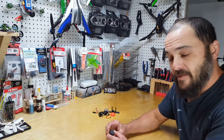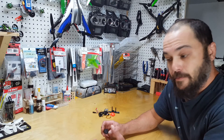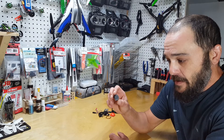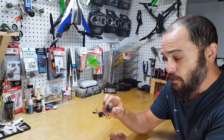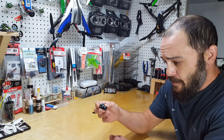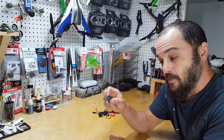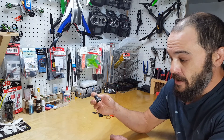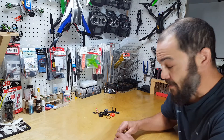The second item they sent me — three-inch machines are all the rage nowadays. Smaller is better, regardless of what kind of motors you're running, and everybody wants the minicams. This little guy right here is 800 TVL for resolution, 120-degree field-of-view. It comes with a wire harness for the VTX — just plug-and-play, ready to go. The coolest part about this thing is it checks in at 9.5 grams with the lens cover, so you can stuff this little guy into a mighty small machine and be ready to rock and roll with some sweet view.